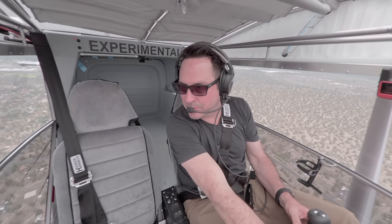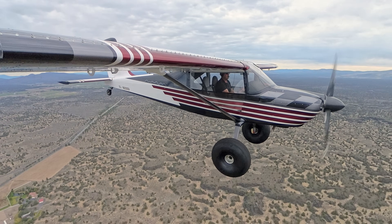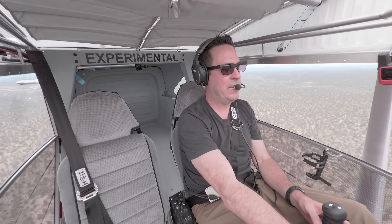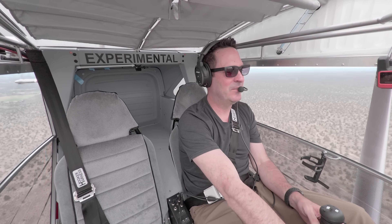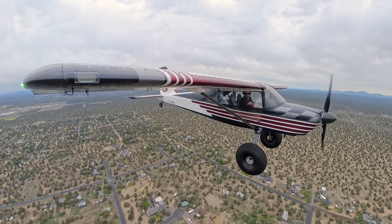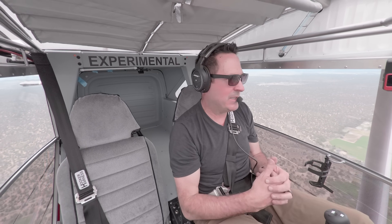It's evening time, a little bit of bumps, not too bad. We've got a strong wind out of the north. Let's go ahead and give it some full throttle. We're seeing if we can beat about 140 miles an hour at this current pitch of the prop at my fuel weight. 138, 139, 140, 141, 142, 143 — at dead level. I need to take some pitch out of this prop, I'm only at 2,630 RPM. A couple miles an hour better — I was hoping for five, but three, this is one test. I'd say three miles an hour, but I expect to see a few more. The true test is going to see how it does on this long distance trip.